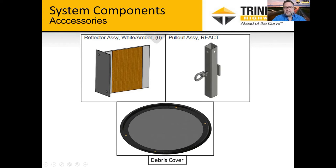Here's an important tool for maintenance: the pullout assembly tool. This slides inside the front cylinder, and an eye bolt goes through the nose cover and through the cylinder itself — that's how you pull out the system. You hook a chain with a hook to this system, pull the system to its original length and hold it for 10 to 15 minutes. That should set the memory of the cylinders back to close to the original configuration. There's also a debris cover — a soft tarpaulin material that attaches with self-tapping screws into the cylinder itself to prevent debris or snow from falling inside.